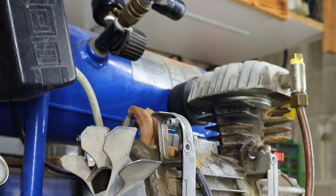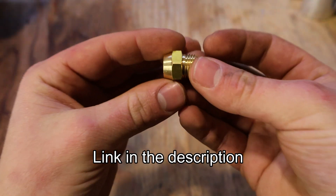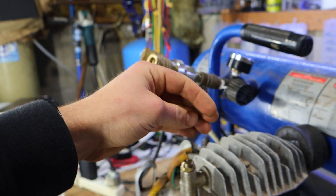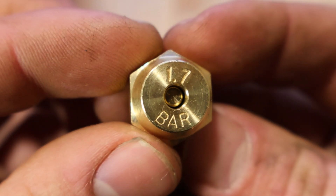As you can see, the compressor is struggling to start up — not again. This is because this kind of motor does not have a lot of starting torque. To solve that, this compressor had installed a special fitting called a cold start valve. Which, as its name suggests, stays open on start-up, letting the motor run without a load, and then closes at a certain pressure — in this case 1.7 bar, or about 25 psi.